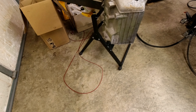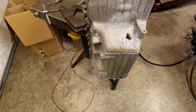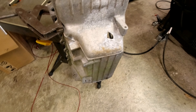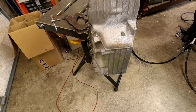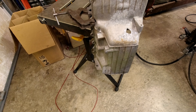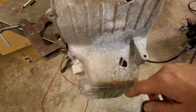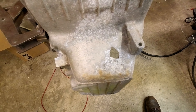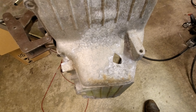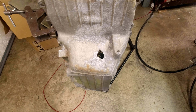Let me show you the process and we'll go from there. We're going to demonstrate on this old oil pan — got it out of the junkyard just for this purpose. The scenario: we hit something and knocked a hole through it. It could just as easily be a transfer case or something else — they're cast aluminum as well. So how do we fix it? First thing, we're going to get everything cleaned up. There's a bunch of cracks we've got to take care of, clean the back side, and then there's going to be some welding involved.